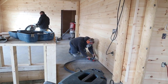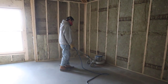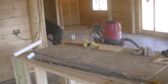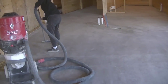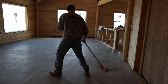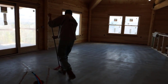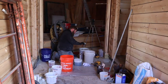The first thing we do is prep the concrete. The concrete was in pretty good shape — it was power troweled nice and smooth. In order for the epoxy floor coating to adhere to it, we've got to grind the surface and put a good profile on it for the epoxy to bond to. We grind it with our walk-behind floor grinders. I've got a buffer here with diamond grinding pads to get a good profile on the concrete. Once we've done that, we've got to get it clean and get all that dust off. We vacuum it with a HEPA vacuum, and then we wipe the floor down with a microfiber mop with denatured alcohol. That picks up any fine, loose dust particles that the vacuum didn't get — you'd be surprised how much dust is left over after vacuuming twice.